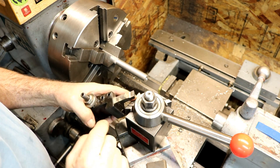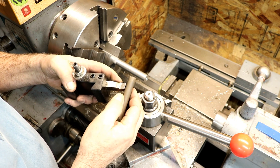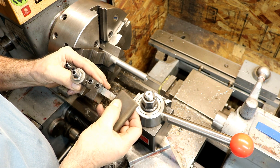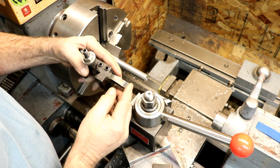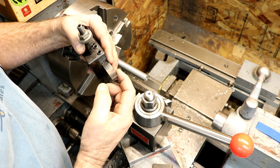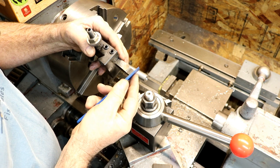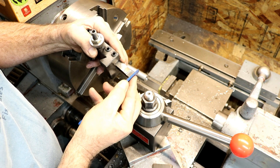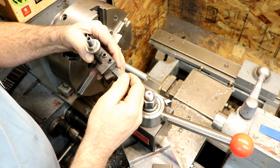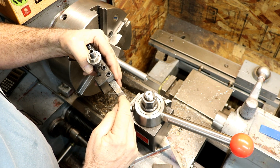The biggest thing I have found is that before you use your high-speed steel tooling, take time to take a stone and hone the faces, the relief angles, and the top to make sure you have clean sharp edges on your cutting edges — or if you have a nose radius, a clean radius. You can even use something like this easy lap diamond superfine and just gently go on these faces, go around your radius and top. What you're doing is making sure you don't have any dings, chips, or welded material from a previous cut or previous work on your tool.